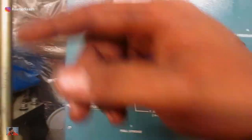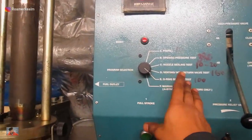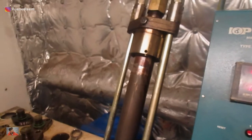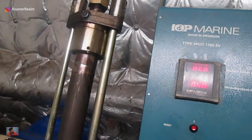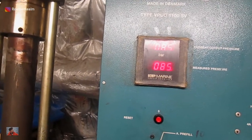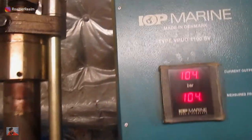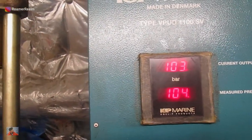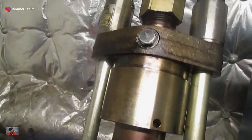For the next test, I'll have to remove this hose meant for oil return and plug this outlet. For the final test now, the knob is on E, which is for the O-ring seal test. Same procedure as the other tests — I start by pressing reset, then close the relief valve and start raising the pressure. The idea here is to check that the seal rings inside the injector are working and not leaking. The oil return channel is plugged here — I've used a normal brass plug of matching thread. Next step is to raise the pressure to 105 bar. At that pressure, the pump will cut out and then the idea is that the pressure should be maintained and not start dropping rapidly. The pressure is almost 105. Now at 105, the pump has cut out. We just have to see that the pressure maintains. It's at 104 now. This plug is also not a perfect seal, so there's a small drop of oil that has leaked. 104 is okay.